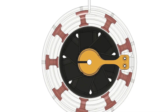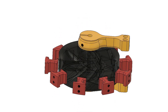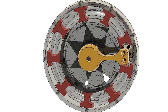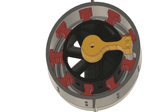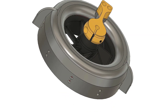For the first design I've been working on an axial style turbine. The working concept is kind of like the lily pad Kickstarter device offered a few years ago. This turbine has the magnets right on the turbine itself and the coils mounted inside the housing. For bearings I went with a stainless shaft and a plastic bushing design for the axle load, and for the thrust load I 3D printed a couple bearing cups using six millimeter balls from an airsoft gun.